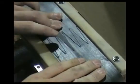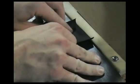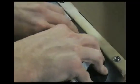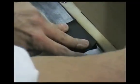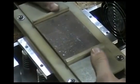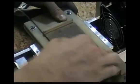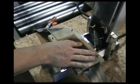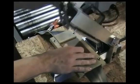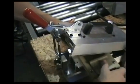Next, add the foil. Remember to place the shiny side facing down. Now place the top of the heating plate on the belt to press the belt ends and the foil firmly together. Be careful to align the two narrow bars on the top of the plate with the edges of the top heating platen. Pull down the handle of the welding unit to hook the latching mechanism and then push it back to lock the clamp.